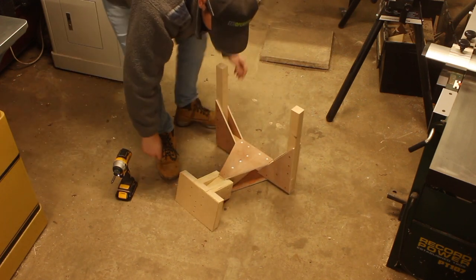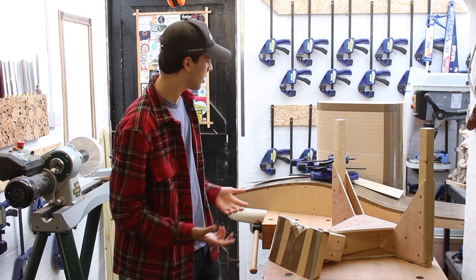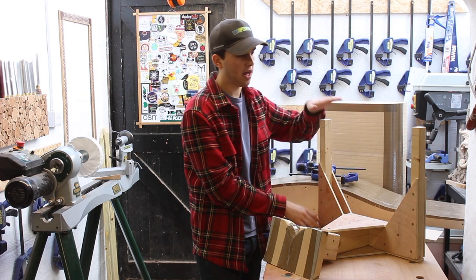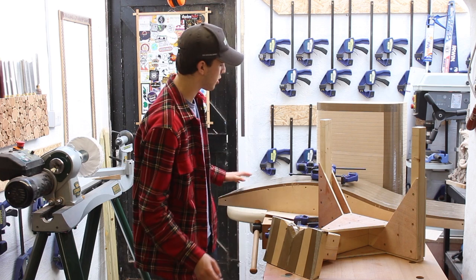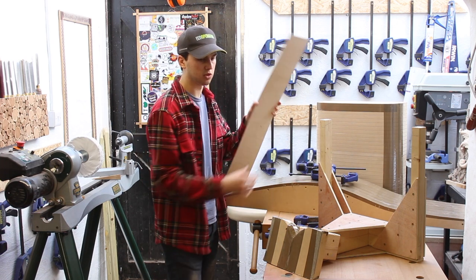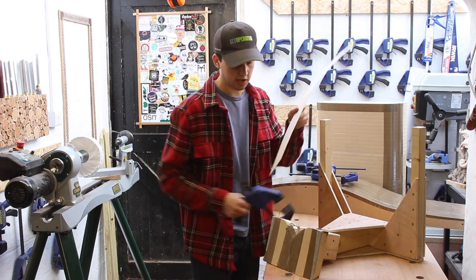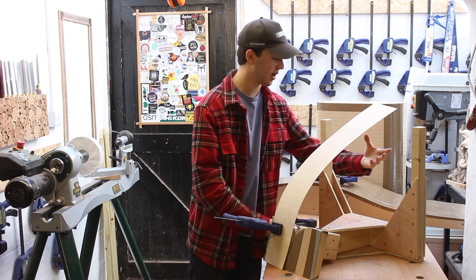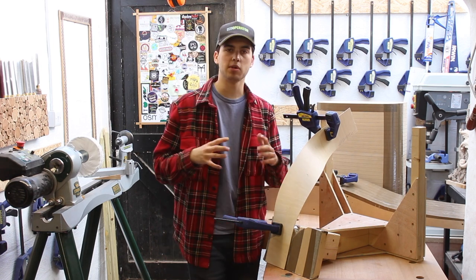That's the mould pretty much done. And that is the last mould complete. I know it looks very odd, but just to show you how it will work — the two key parts of the mould are this surface and this surface. The distance between here and the height of them are in the exact position where the rails are going to be mounting into the legs. And this surface here perfectly matches the bottom of the back mould, so when this bent lamination comes off the mould I'll be able to glue this section onto the back and then it will join onto the legs as well. So I'm going to cut up lots of thin strips of FlexiPly — I've just got one here for the demonstration. The way I'll form these components is I'll add lots of glue in between all these layers, clamp them on the bottom, and then twist the FlexiPly into the right shape and clamp it up.